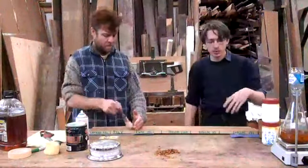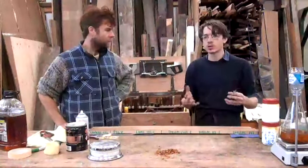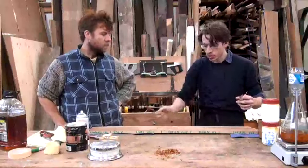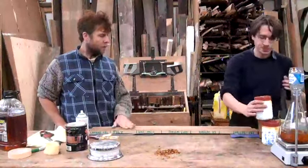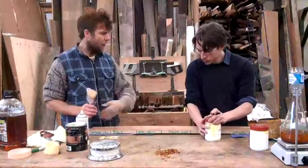So you want to leave it for a few hours mixing up, and maybe overnight, to make sure that as much of it dissolves evenly throughout the metho, and you don't brush it on and get a chunk here and there. Also, with this dust that we've just done a bit of a light brush, would you go over with a metho and wet it first and wipe it off?